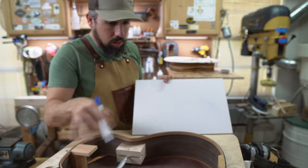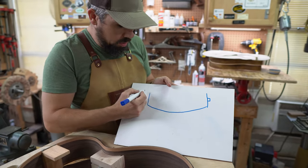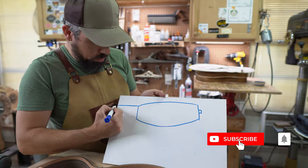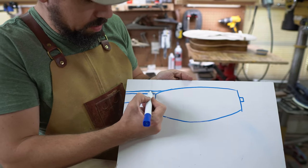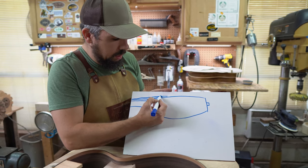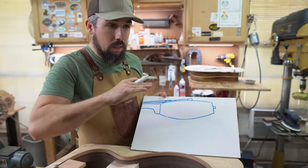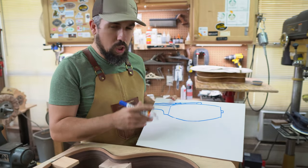Let me draw it out — here's our guitar body, here's the back, here's where the end pin goes, here's where the neck is. If we put a 30-foot radius across this whole thing, what happens is that where the neck is, the fingerboard angles upward. So your strings come across and you can easily have a buzzing situation right at the bridge because it just doesn't want to connect. Martin, Taylor, Gibson — all those guys have automated machines to handle this, but for those of us without those machines, we do it by hand.